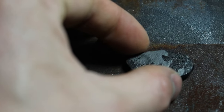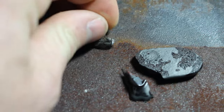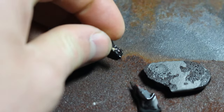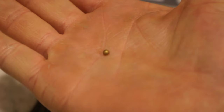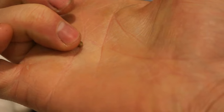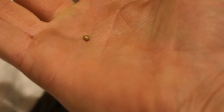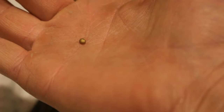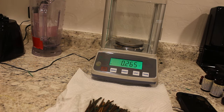It's now cooled off and I was looking through this. I didn't really see anything that looked like gold until I turned this one around — and look at that, there's a little bead inside there. Let's get that out and see how much it weighs. So here's those RAM fingers and here's the gold recovered off of them — so small you can hardly see it. There, now you can see it. A little tiny bead of gold. It's probably not 100% pure — you notice its color is a little bit off. It's probably got a little bit of copper in there, but it's pretty much too small for me to try to refine it on its own. So let's just weigh it and figure that it's mostly gold. Just under a third of a gram — actually that's a quarter of a gram. That's certainly not very much.